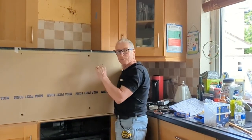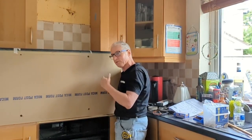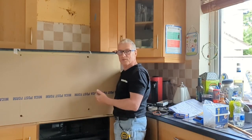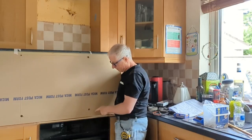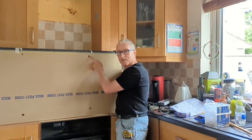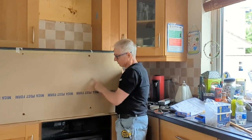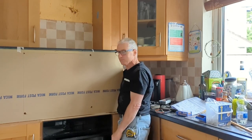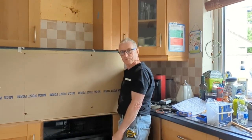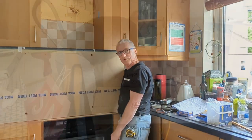You can cut them from the top — just make sure you have a very good blade; sometimes you might need to score the surface. Rather than doing that, it's more work. I always do them from the bottom: if the pilot holes are in, all you have to do is join the tangents. Tangents is a line that touches the outside of the circle but doesn't go through it. So you just draw a line tangential to the outside of the circles and you've got your job done. I'll just go outside and cut that out with my jigsaw and we'll come back.